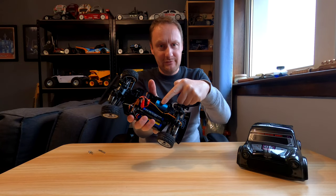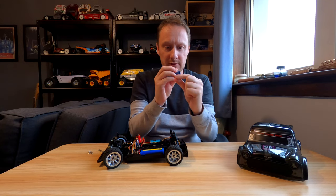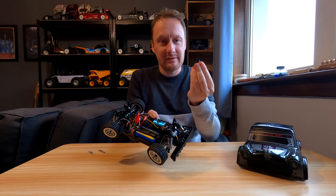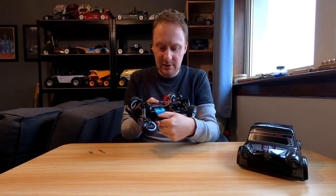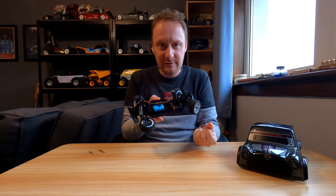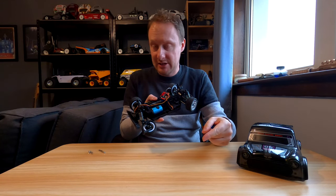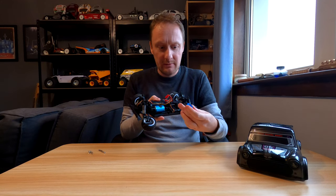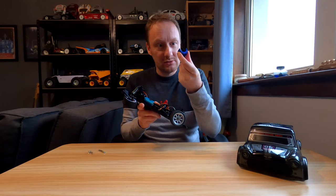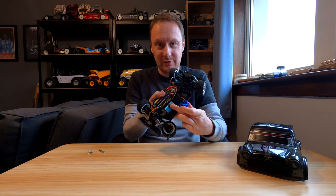If you use adhesive, you've basically stood this off the motor, even by a fraction of a millimeter. You've got a surface between this and the motor. This is going to have no heat sinking effect whatsoever. This is not thermal paste like you'll find on a computer processor. This is just adhesive. Doesn't thermally transfer heat, at least not very well, so this whole thing was redundant anyway. If it didn't fit right, then they should be redesigning the heatsink so it does fit right rather than compensating or trying to stick it in place.